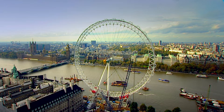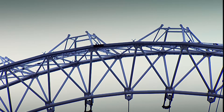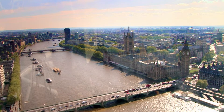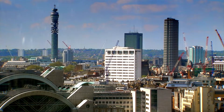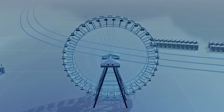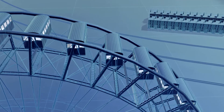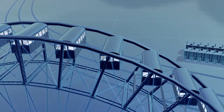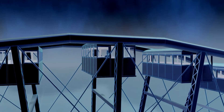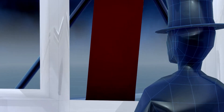With the wheel in position, engineers had to fit the passenger capsules — their design was critical, and the view out had to be unrivalled. But there was a problem with traditional passenger cabins. On early observation wheels, cabins hang from pivots attached to the outer rim. The cabins can swing freely, so as the wheel rotates, gravity keeps them level. But at the top of the wheel, when the scenery should be at its best, the struts of the rim block the view.